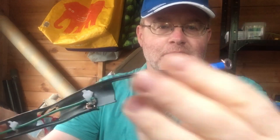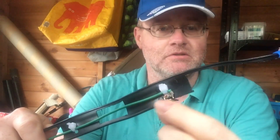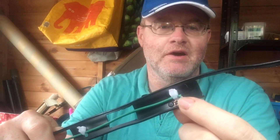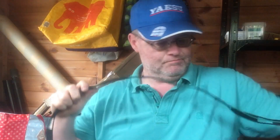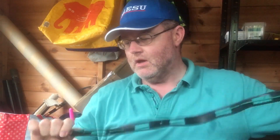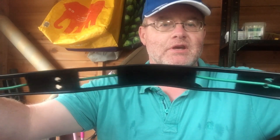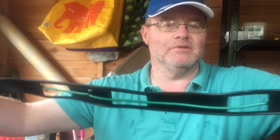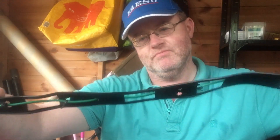What we've gone and done is added a third wire. You can probably see the green wire running through the middle. Effectively, I've kept the two wires as they were, shorted at the ends. At the end closest to the balun, this wire goes to the balun, and the wire that wasn't doing anything — I've now just very crudely, just for experiments, attached the centre wire to that wire. So we've now got a third wire going back down the middle of the ladder line. I've punched some holes every few inches and just woven the wire in and out through the ladder line, with cable ties to keep it as close to the centre as I can. It's a bit crude, but it works.